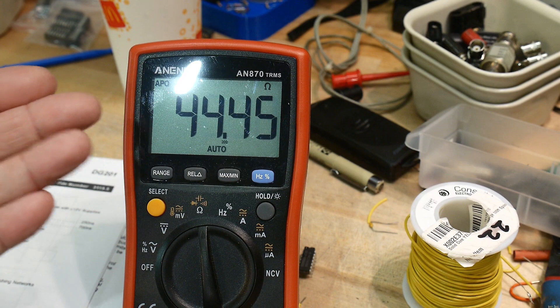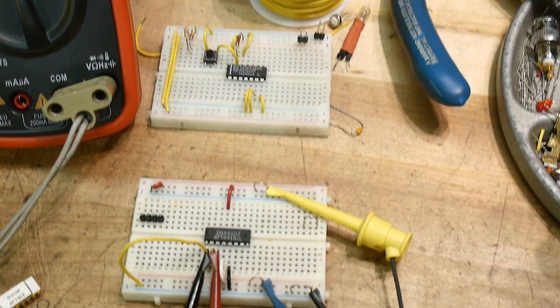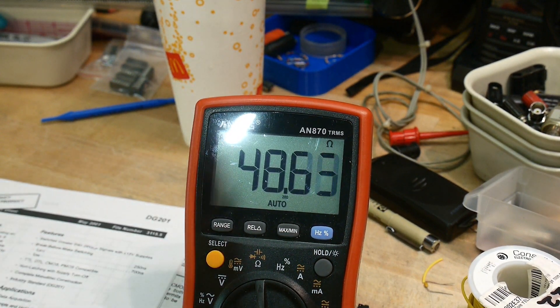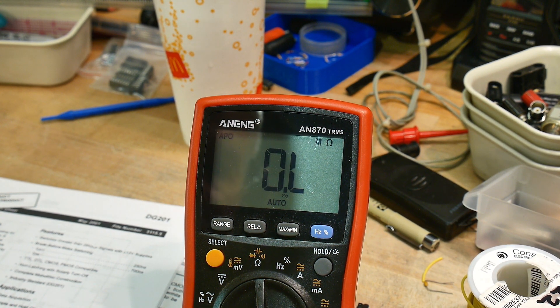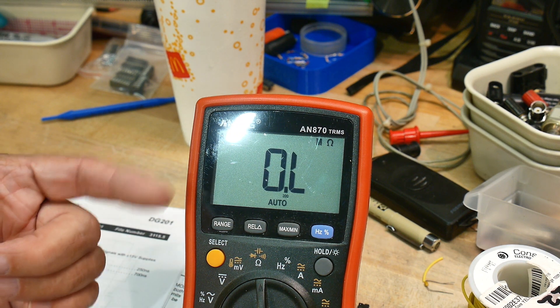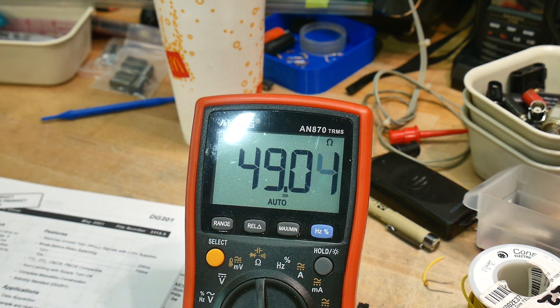The DG441 is an upgraded part — only about 40 ohms on-resistance. If I pull the input high to disable it, it goes into the megohm range, sometimes reading 19 megohms or so — definitely off. Then if I ground the input to turn it back on, it goes to about 50 ohms. So there you go — a clear on/off transition with good isolation.